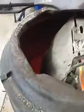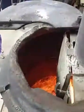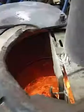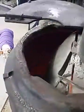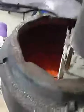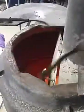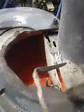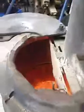When I open the lid, the flap drops, but you can just see it here. I've fashioned a bit of small diameter rod to act as a sort of catch, so when the door closes it picks up the flap, and it's hard for me to show it, but as the door closes it picks up the flap, and the flap becomes fully closed. I can't fully close it with the rod here, but when the lid comes over it'll fully close the flap, and there's a gap around the side here, and I estimated the combined gap around the outside is probably the same diameter as the chimney, so I'm not actually choking the fire at all.